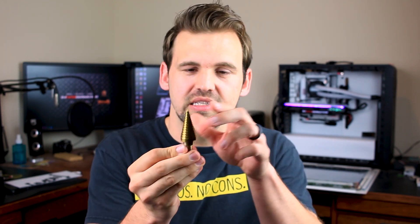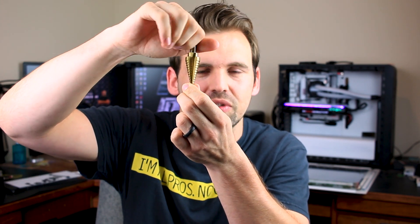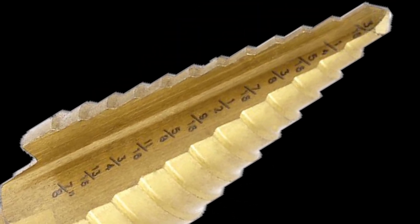Another tip is about drilling for the magnets. Use a step bit instead of regular wood bits. When you drill into acrylic, wood bits tend to splinter and shatter the material, whereas a titanium step bit presses down and pushes out as it goes in. These bits have different steps so you can make different sized holes without changing bits on your cordless drill. There's a link in the video description. If you don't want to buy a step bit and want to keep using wood bits, just make sure you lubricate the tip of the bit before you start drilling — thanks to Stephen Hamrick for that tip.